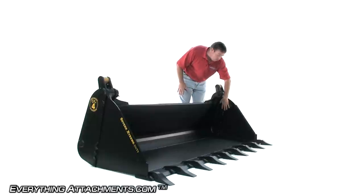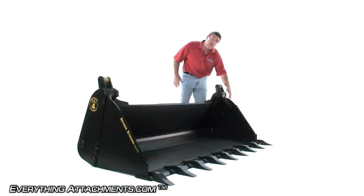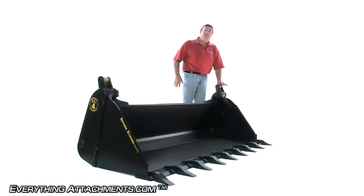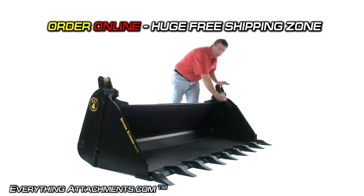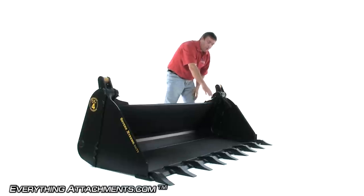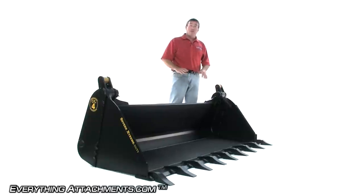This has a very high nickel carbon casted steel hinge. That does two things: it makes it absolutely stronger than any type of regular steel that we could use, and it saves space and helps keep the weight of this bucket down. You've got the bottom clamshell that's super reinforced, and there's a whole other bottom under this. There's an eight-inch wide back rail brace directly behind the three-quarter-inch thick cutting edge that's eight inches wide on the front, plus several brace strips — all the bracing and beef that it takes to handle 100-plus horsepower track machines.